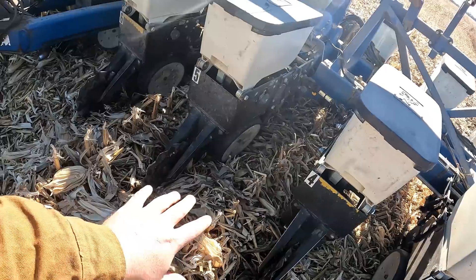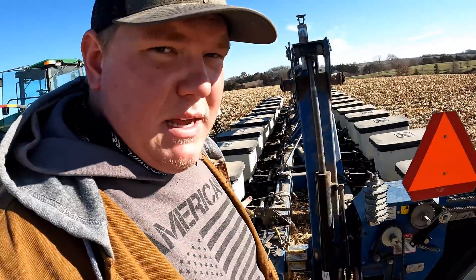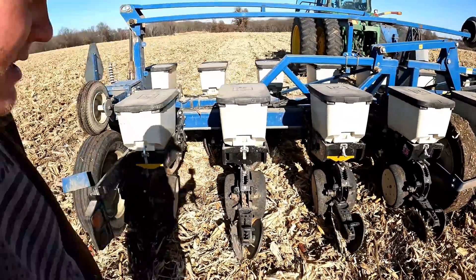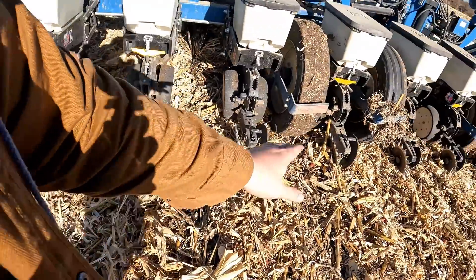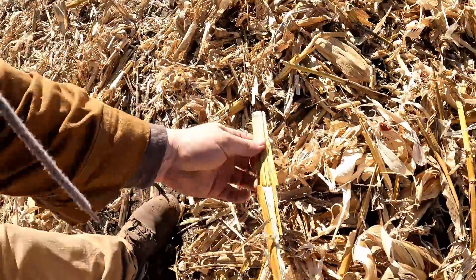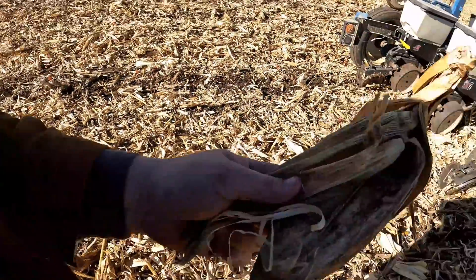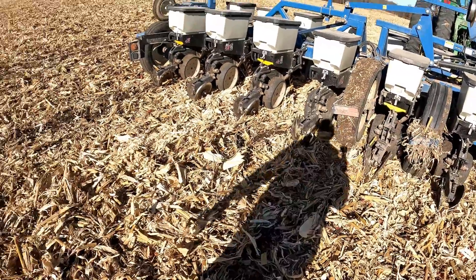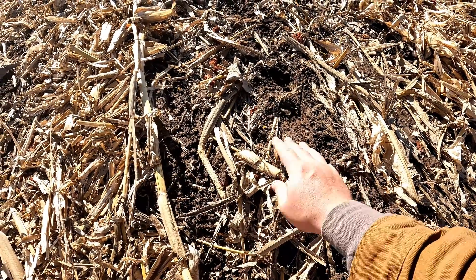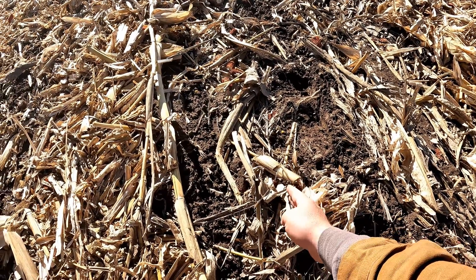As you can see, my front row units are right in the middle of the rows — 30-inch spacing on the front, and then on the back they're offset so we're hitting all the rows and it's mulching them up, chopping the stalks into finer pieces and breaking them up without doing a lot of soil disturbance. Right here is a row and right here is a row, and with this level of correction next year I'll be able to shift over my guidance pattern and plant my soybeans right between them.